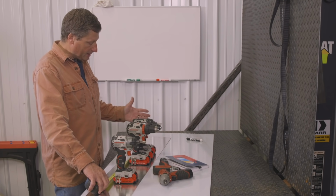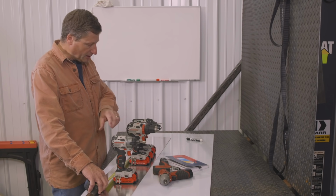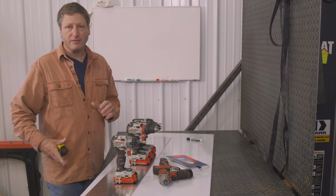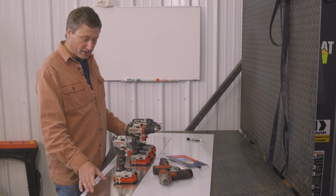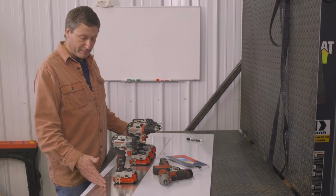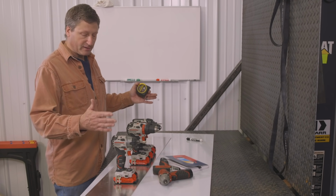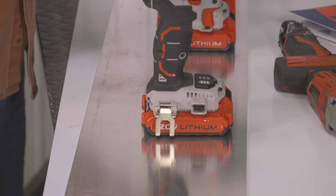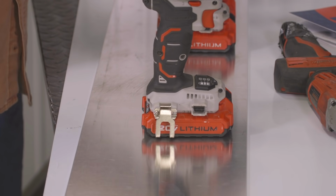So I'm going to make that tool holder shelf 23 inches long, and then I'm going to lay out where I need to cut those slots. As I was thinking about this, I think what I'm going to do is make these a little bit longer. I'm actually going to make the sides on this piece and put it in my brake and bend those up. And that's going to add a little bit more rigidity to this shelf, and it's going to give me a position to weld the second charger shelf up on top.